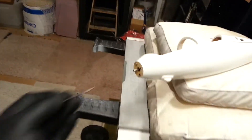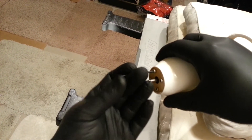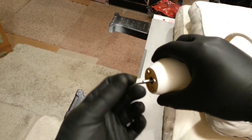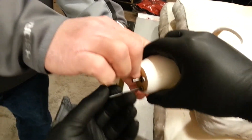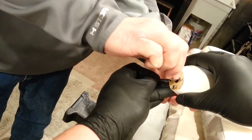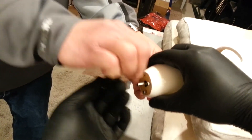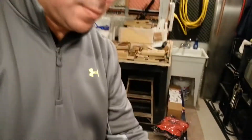We've got a two millimeter Allen key. You want to grab that and try to start screwing that out - the one I just loosened - and then we can both be hands on deck. We're just going to undo these screws all but the last thread and then push, which should help pop the motor free. Why is there so much pressure? You didn't glue it on there, did you? If we drop these screws, just don't let them get too far because there's always four million things in the way.